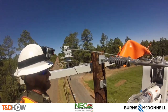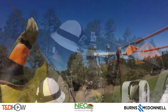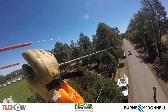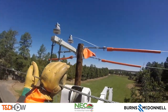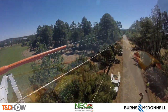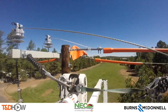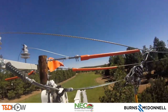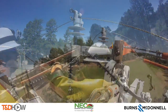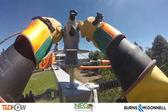Once the middle phase is secure, they will start on the third phase — the roadside phase in this case. Here they are bringing that third phase over onto its insulator on the cross arm. Then, using that come-along once more, they create a dead end on this third phase. And nicely here we get a great shot of that jumper across the cross arm.